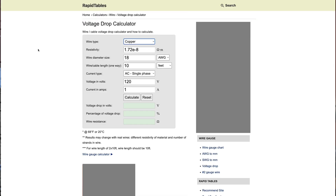In how to use the calculator, you will select your wire type, size, cable length, current type, voltage, and the maximum amperage. The calculator will tell you the voltage drop, the percentage of drop, and the wire's resistance. For example, I want a 6-foot power cable for my transceiver. If I select 12-gauge wire, enter the length of 6 feet, select DC current, 13 volts — the nominal voltage of my battery — and 20 amps of current draw, I'll get a voltage drop of 0.38 volts, or 2.93%. That's just under the 3% target, so 12-gauge wire would be the proper size. If I change the wire size to 14-gauge, the voltage drop percentage climbs to 4.7%, which is outside the recommendation. I'd either have to shorten the cable or use it in a lower amperage situation.